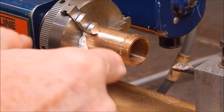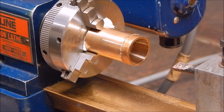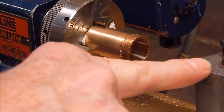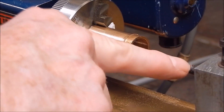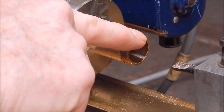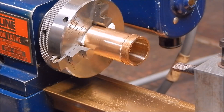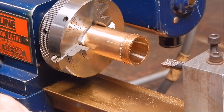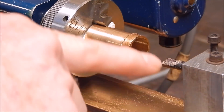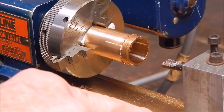You can see it's machined this side all right — that finish is pretty okay. So yeah, it's certainly usable. You can get a 6mm as well — the 6mm shank would go straight in, you wouldn't need a spacer. I'm pretty sure that would bring it right onto the centreline. But putting a washer in there's no big deal. The 7 works fine, no problem whatsoever. You can buy the 6s and 7s separately, and they also do a 7 with 10 inserts for about $13, or you can buy the bar on its own for about $4.